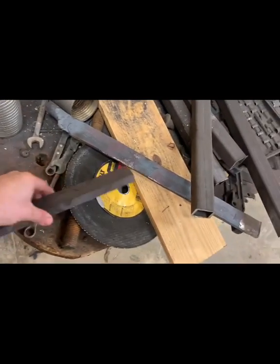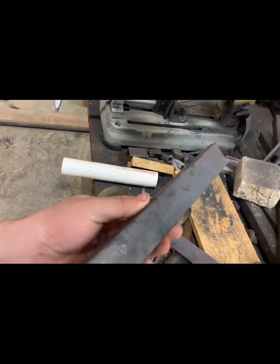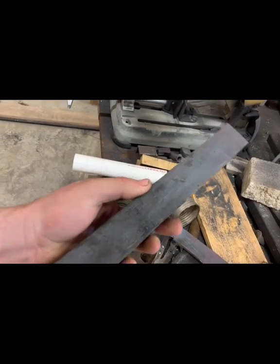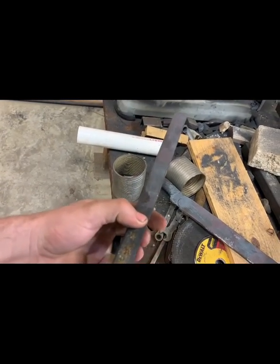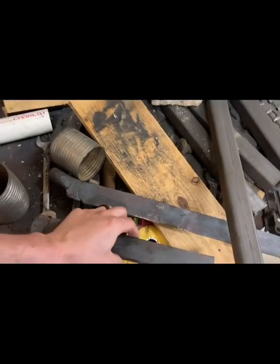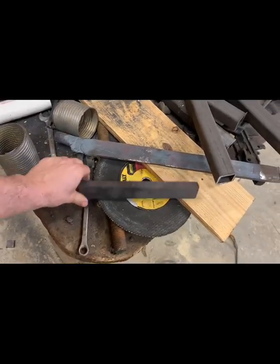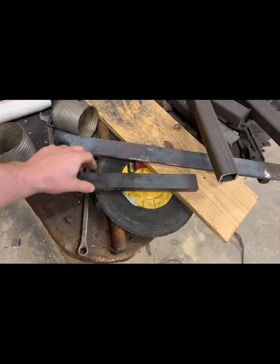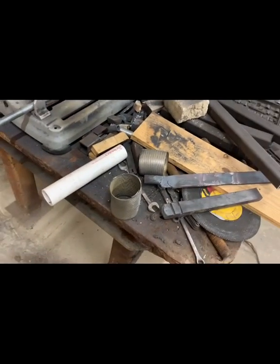I've already got some Damascus made. This is plenty. Now what this is, just a straight 100 layer stack, no pattern or nothing. So I think I'm gonna cut this in half and put me a solid core right in the center in a sandwich technique. And let's weld this up. Maybe put a little pattern on it for prettiness. And yeah, let's make some steel.